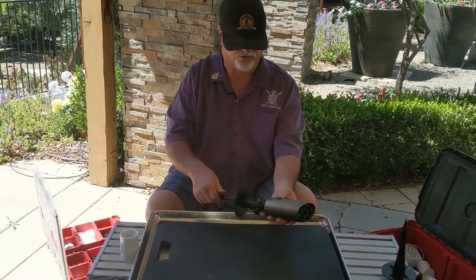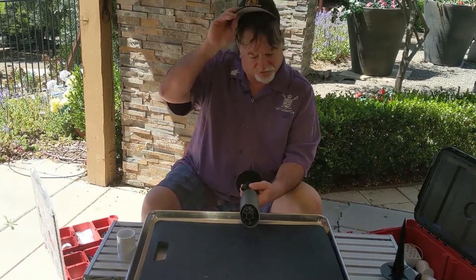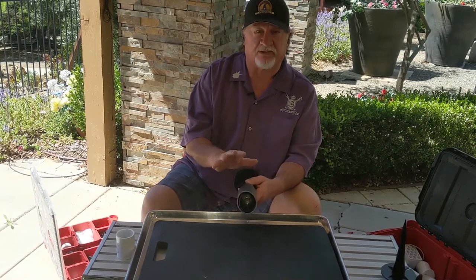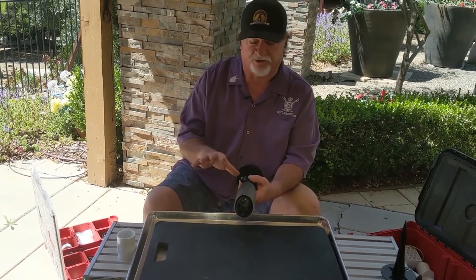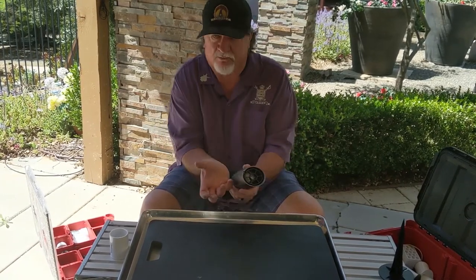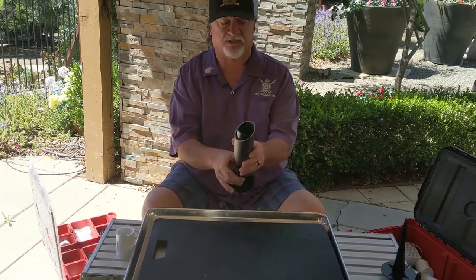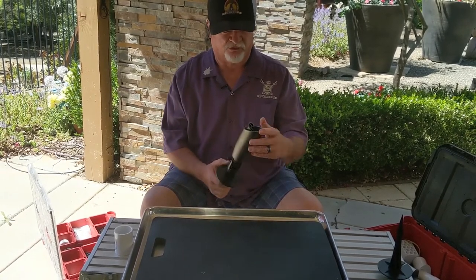The knuckle is removable — it easily spins out. As a lighting person, certain things are extremely important to me. You can't be a lighting person if you can't adjust the fixture, and you can't be a lighting person if you can't eliminate glare. We make the best fixture for eliminating glare — we may be the only manufacturer that even deals with glare. Because the hex louver comes up from the bottom side of the shroud, I can rotate it 360 degrees and block out glare up to 280 degrees, virtually eliminating glare almost entirely.